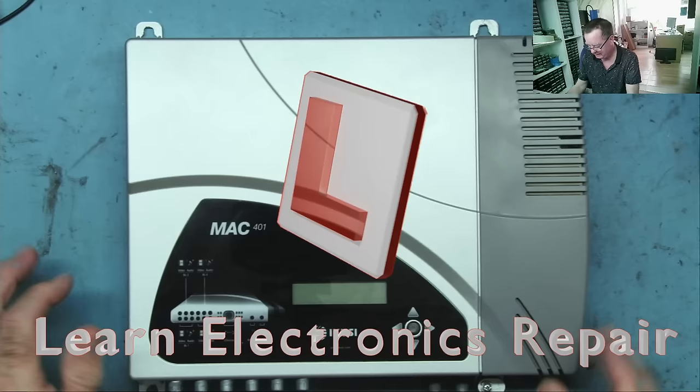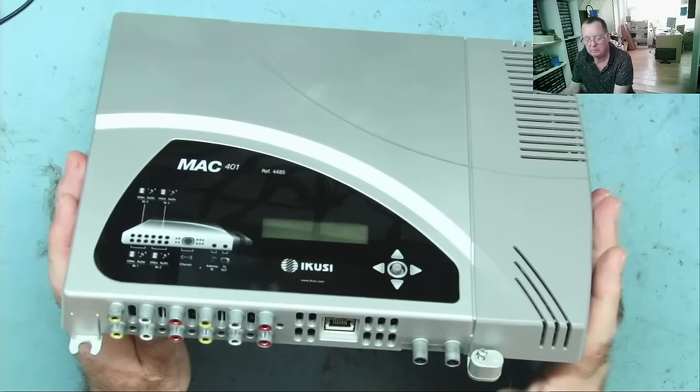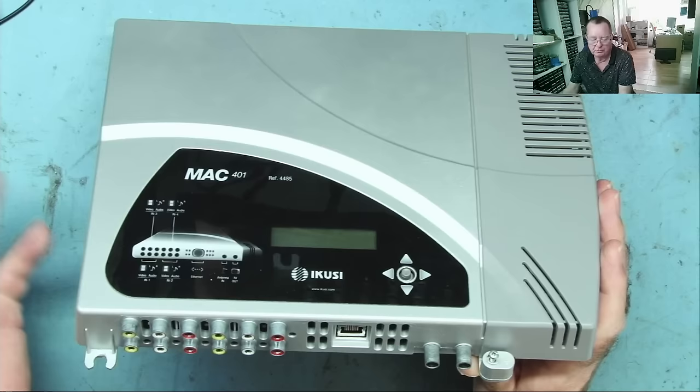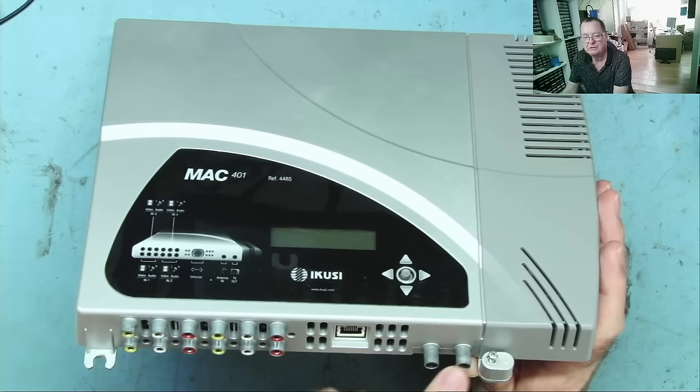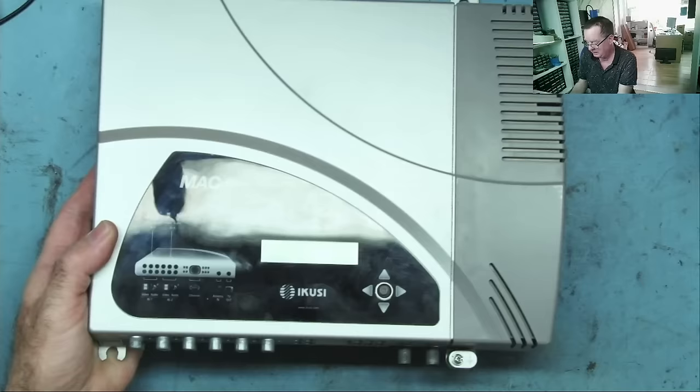This is a modulator, this thing. It's a quad DVB-T modulator. In here you connect up to four AV sources, satellite boxes, whatever. This is standard definition. And out here comes one RF frequency with the four channels on. So it creates a digital multiplex with four channels on the same carrier frequency, and that goes into the TV